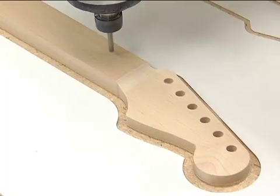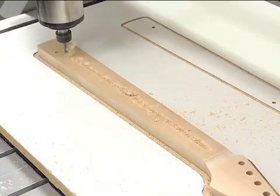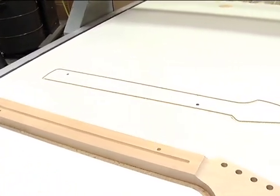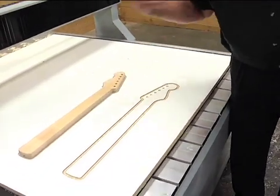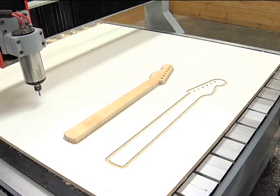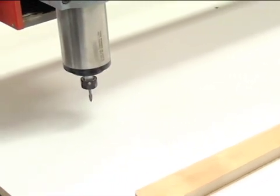We've got all the machining done on the front side of the guitar neck. We've got our contour cut out, holes for the pegs, the slot in the center, and our locator pins. Now we're ready to take this off, put the pins in the holes, locate it, and machine the back side. We're set up now in the second position to do the back side. Primarily we'll be cutting that hand surface we looked at on the computer, and when done we'll go around the perimeter with that finish cut to take off the allowance we left on the other side. The first tool is a quarter-inch ball mill, using a number of different cutting strategies.